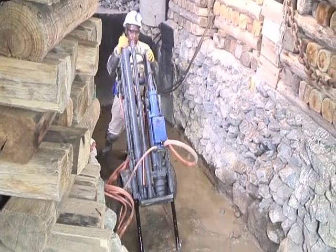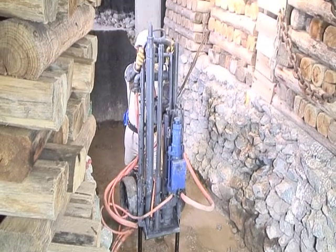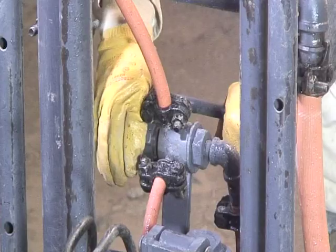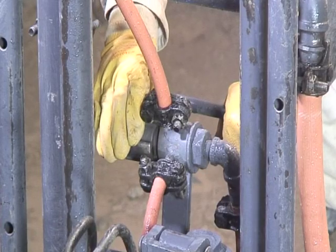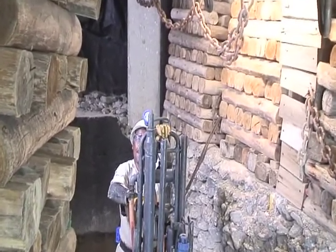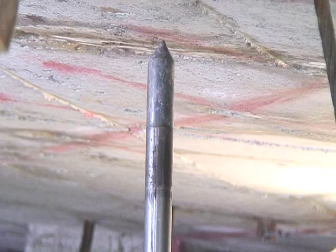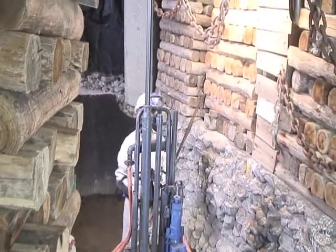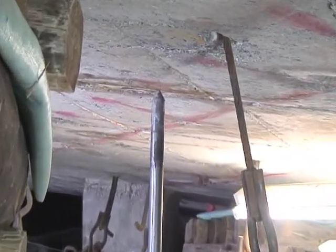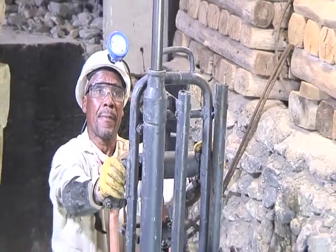Lift the drill rig off its wheels onto its extended footpiece and reposition. Open the stinger's valve, extend the stinger, and retract it again to verify its reach. Accurate drilling is achieved by firmly securing the drill rig. Check that the drill rig is firmly secured.